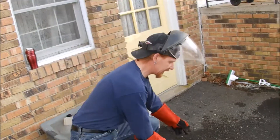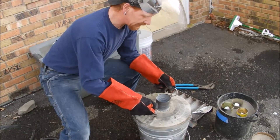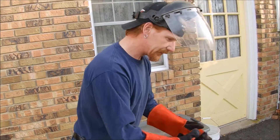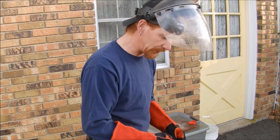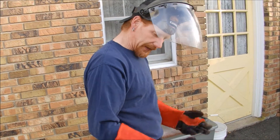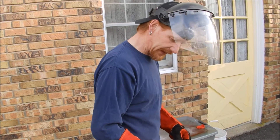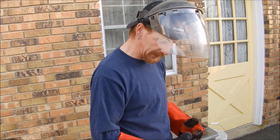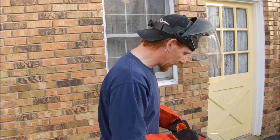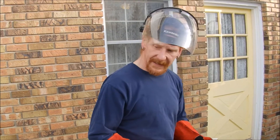There were a lot more impurities on the last pour because I still had remnants from a previous pour left in there. But this one — this stuff has already been melted down and all the impurities have been taken out of it, so it's almost pure aluminum that I'm melting back down. That's why you're not going to see a lot of waste in this one. We're going to do a little degas and then get ready to pour.